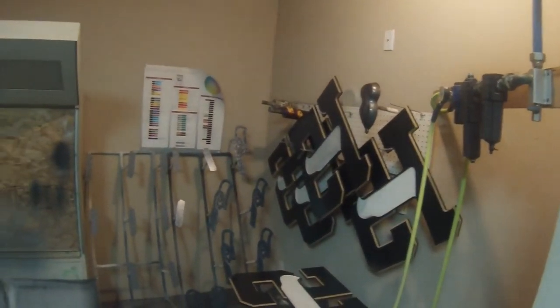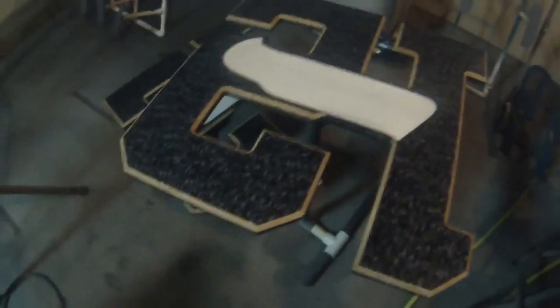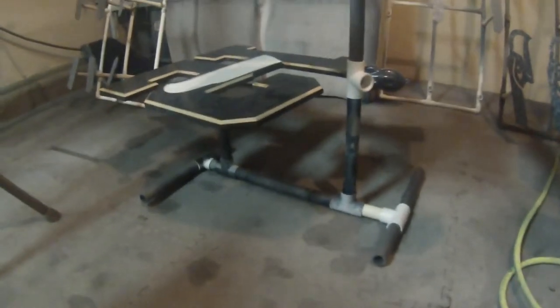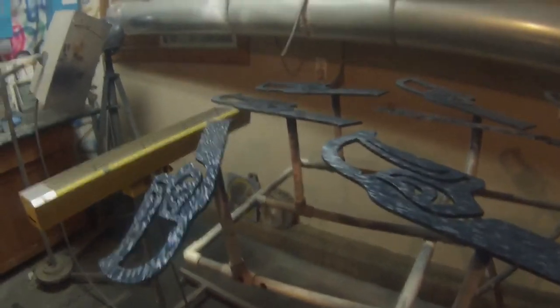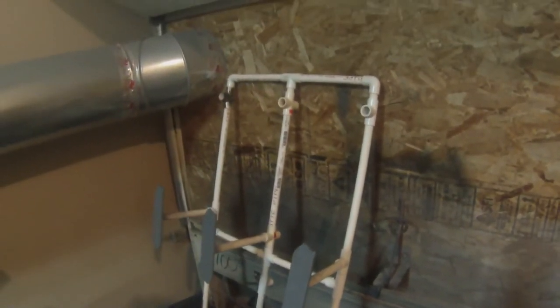In the back of the room you can see more PVC receivers — they're all about the same size because that's the rinse station size. We use half-inch PVC piping as handles for our objects, and it also fits into the receivers. The first ones we just did are all dry, and we're setting up a receiver below in tiers — five or six of them — so by changing the height of the PVC we can consolidate them into a very small area. There are more Seahawk heads all in the same receiver. Anyway, I hope this helped — this is Dave with Tsunami Hydrographics. Go to THCcoatings.com and give me a call if you have any questions.